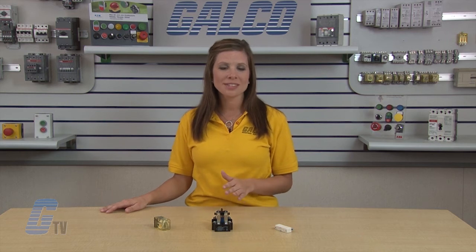The contact points are often plated with gold or another low resistance material to increase conductivity. Therefore, reed relays are usually designed for small signal switching applications that require clean and low resistant contacts, as opposed to power switching applications that are less prone to conditions affecting conventional electromechanical relays. These relays respond very quickly because of the short distance between the reeds.